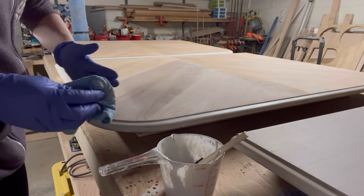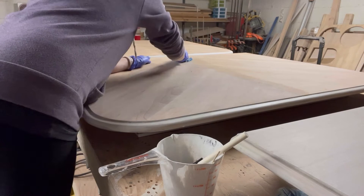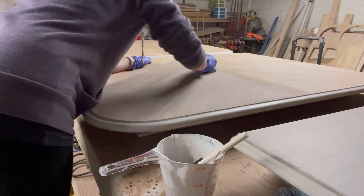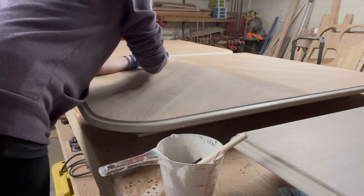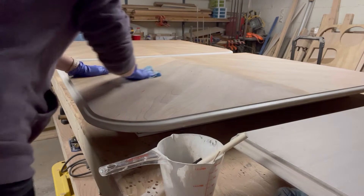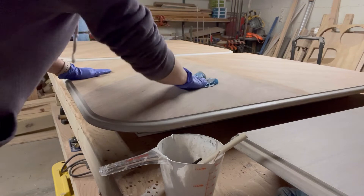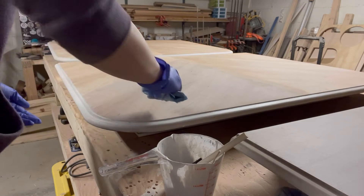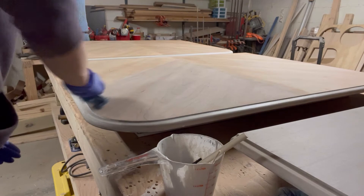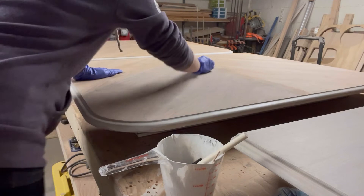When applying it, after I've applied it to an area, I take full swipes because you don't want to stop midway and pick it up — you end up with a brush mark, and that shows up in the end. I'm going to focus on that center line and make sure to wipe off as much as I possibly can. Make sure everything looks nice and even. I had a little overlap between the first and second sections, so I got more of that off. Along the edges, pull back and make it smooth — otherwise you end up with a thicker line around the edges. Now I think we're looking good and I can start the next section.